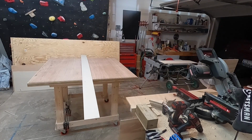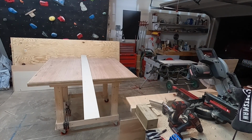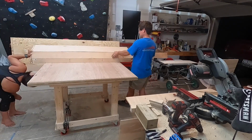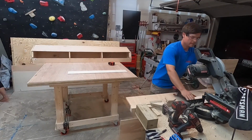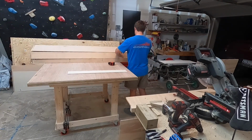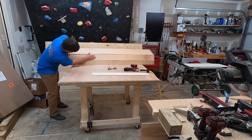But we really wanted to have a sturdy cabinet system, and I didn't want to have to hang it with 500,000 screws. There's only a couple screws put into the cabinets to hold them in because they are so strong. Another thing that you saw me doing is I used my assembly table as an outfeed table for the table saw. I made it the exact height to help with bigger sheet goods, because a full 4x8 sheet of plywood is a bear to manage going through a job site table saw. Now, if I had a full wood shop and a table saw with a bigger table, obviously that would help. I know that because when I went to my friend Justin's shop, who is the owner of Diverse Designs, which you'll see later in this video, he has one of those table saws that's really nice to use, and it makes things a lot easier.